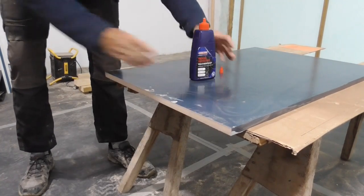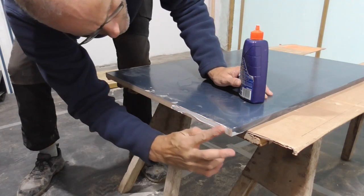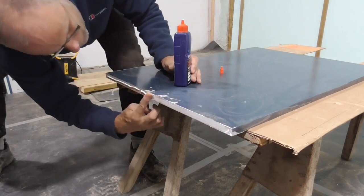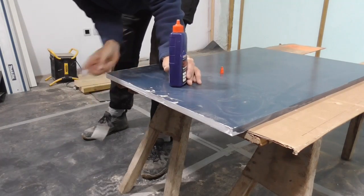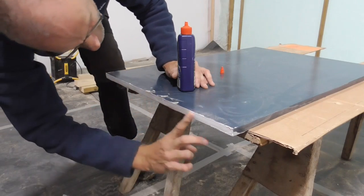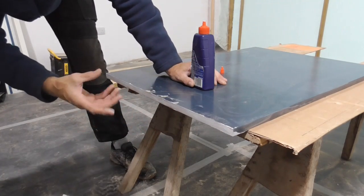That's just a bit of mud on the protective film still on it. I'll just put a little PVA on it — I'm going to use my finger, it's good enough. I'll put a little bit up that back cut edge as well. I'll probably give that maybe half an hour, 40 minutes to tack off, then put another coat on it, let that dry, then go and fit it. That'll give it a fighting chance to stop any moisture getting in there and blowing it.